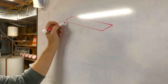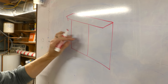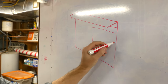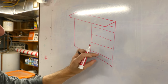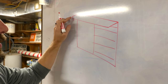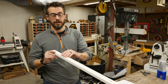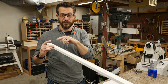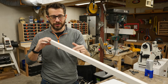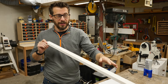We're going to have a shelf that comes off the wall, and then behind that shelf there'll be a board broken up into two areas. One half will be a sheet of metal so we can have magnets to stick things up. We're going to put French cleats and some really simple shelves so they can put shallow shelves up here to hang and show off their little toys. Underneath the big shelf on top, I want to add a little LED strip so they can have some down light onto their work surface. The main part is going to be a simple mitered frame on the outside with the shelf on top. For that frame I got some pine 1x2s, primed, to skip that step. So I'm going to go to the miter saw, cut all these down, and then we'll start putting them together.